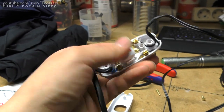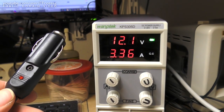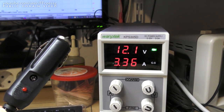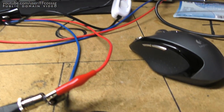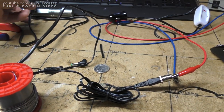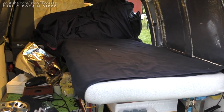But for 12 volts they're pretty much excellent - they have a giant breaker and can handle a fair amount of current. So there we go: a switchable electric blanket. And to make a point about how poor this cigarette lighter connector is - this blanket would never draw more than 3.35 amps with the original connector. But now going through my long test leads clamped onto the DC plug, through two meters of 20-gauge wire, it's drawing about the same amount of current. So all that extra wiring has a combined resistance comparable to just this connector - that's awful.